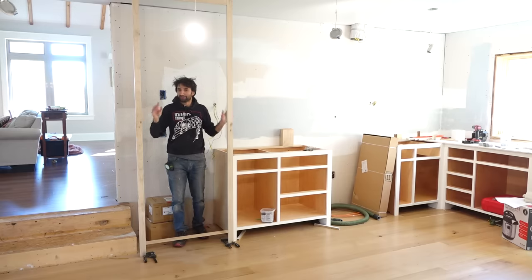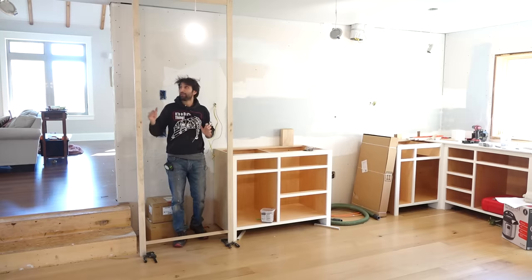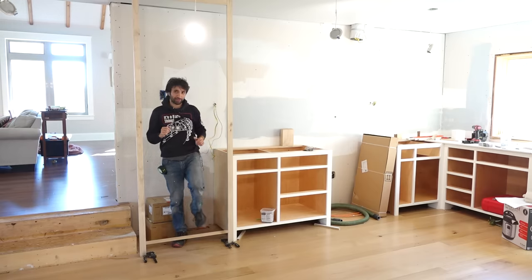So in the first cabinetry video, we made this face frame, having it sitting here. Now I know it's an inch too tall. I'm going to go down to the shop, cut this thing down an inch, get it glued together, and then we're going to start actually making the box, the giant box, which is going to go here and feature that pocket door hardware, which I still have to figure out because it's got a big instruction manual.